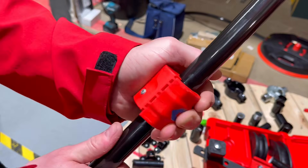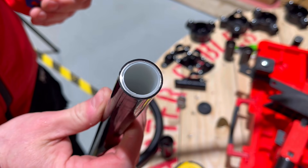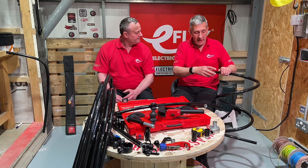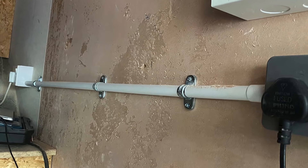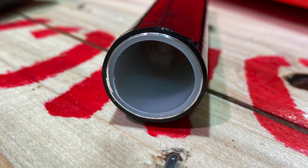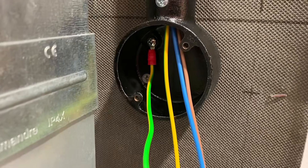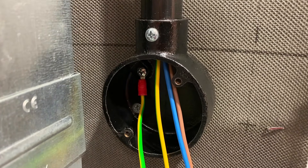The bix cutter gives almost factory-cut smooth ends with no need to deburr — that's my top tip for cutting it. Inside it's a three-layer construction: an inner polythene core, a middle continuous aluminium core, and an outer polythene sheath. The great thing is it's low smoke zero halogen, which most plastic conduit systems are not. That's a hint back to the advantages of metal conduit. The main application for that is areas where you want great screening — data cables and heavy industrial applications where screening becomes quite important.